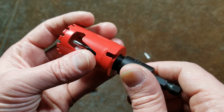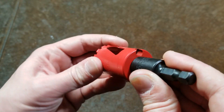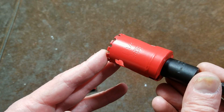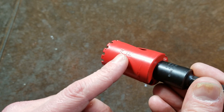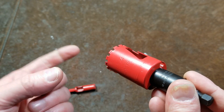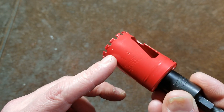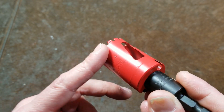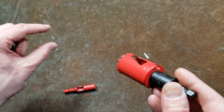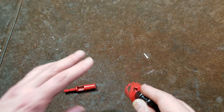One of the reasons they put it in this versus the two-pin is because it offers more stability. The hole saw — you really want it to keep pretty straight. You don't want it to wobble back and forth because that causes a bunch of friction. And an issue I've seen: where you use the bit quite often and don't clean it much on a loose arbor, it's growling back and forth. Since you're drilling through very hard and abrasive materials — these are rated for grade five, known as hard tile — you'll actually wear the sidewall of the hole saw itself. Just the grit brushing against the edge of the hole will wear the steel down until the whole front of the saw falls apart.